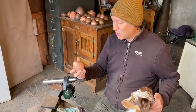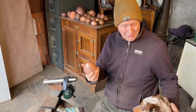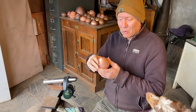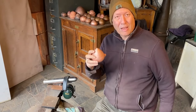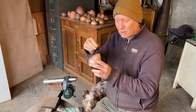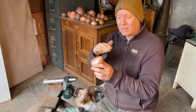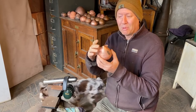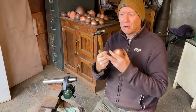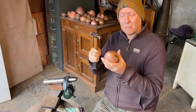Okay, so real quick here now, onto what I consider the last course of raising is the planishing course. And that's different from the others in that I'm no longer trying to hit on the air gap. When I have it on the stake, I want to hit at the point of contact so that I'm squishing the middle down a little bit, not real hard. I just want to iron out the bumps and irregularities, smooth it all out. And for that, I just use my planishing hammer. I like the slightly rounded side, because I like the marks it makes better.